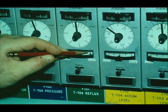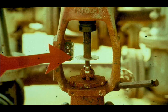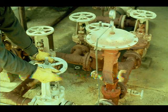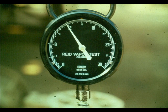This controller has 100% output. You would expect the signal at the control valve to be 15 psi, and you would further expect the valve travel indicator to show 100% valve travel. If the controlling instrument output signal, the signal at the valve, and the valve position do not correspond, there is a malfunction. Ask the operator to bypass the valve and install a 0 to 30 psi test gauge at the control valve. Verify that the controller output and valve signal agree.